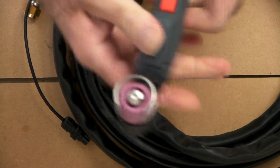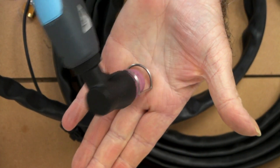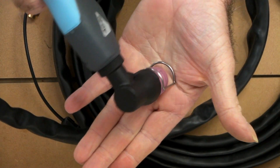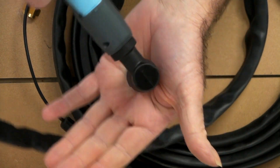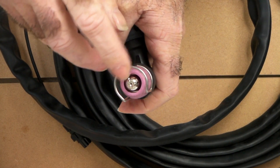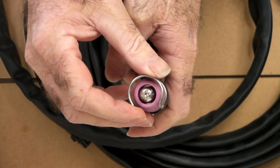The advantage of this is you can steady your torch a bit better — you can guide it around and you have a whole lot more control, because you're not pivoting on the cutting head or on the torch tip. So you've got all this area here to give you more stability and you can actually steady the torch.